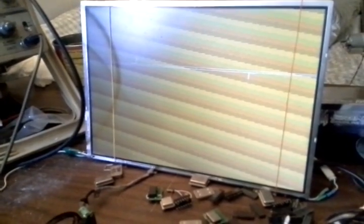And so I think this is the second one that I've worked with like this. And both of them, 2 entirely different manufacturers, seem to work fine, where even if you only refresh them less than once every 10 seconds. So 64 milliseconds versus 10 seconds, quite a big difference. And what's happening here is apparently when you open a page and then close that page, that actually performs a refresh on that page.